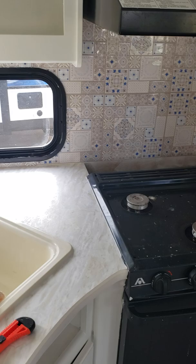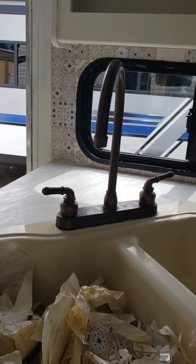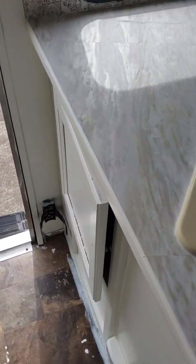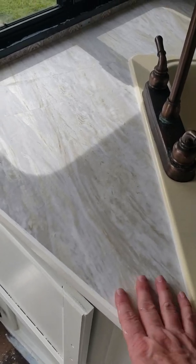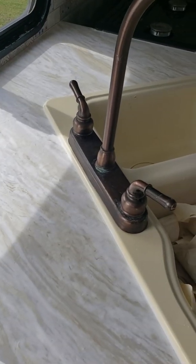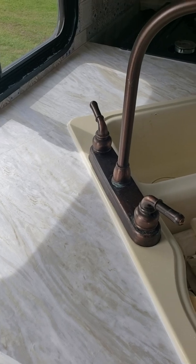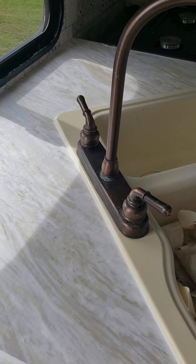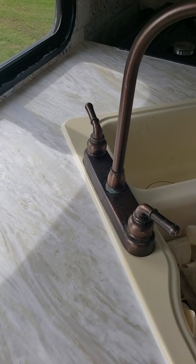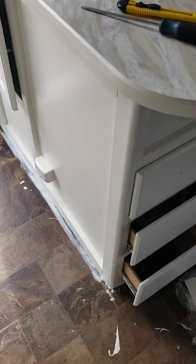That took quite a few hours to do. It went around that window and looks really nice. So the next step is to put the caulking around the window and over there by the stove. Then we put a polycrylic water base — I have to do that because of trial and error. I've been doing it since 2010. You put that on so it won't wet the paper and darken it. You have to put two coats of that on, let it dry, then tomorrow I'll put the epoxy on and seal it so it won't get scratched.